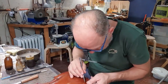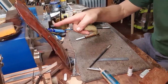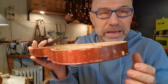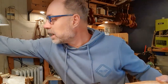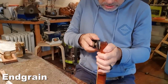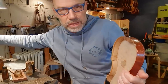Yeah, that's varnish — that dark stuff. It's not actually dirt. I've glued those pieces on and now it's time to cut them back. You can see all these gouge marks here — it's just amazing, I have no idea how they managed to get that kind of damage on there. Anyway, for now I am going to just plane these to the right height. At the same time I have to plane back the top block — it's a little bit too high, and to do that I actually have to wet it because it's something called end grain.